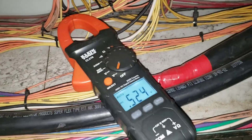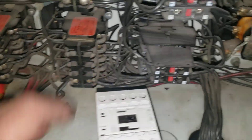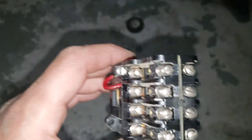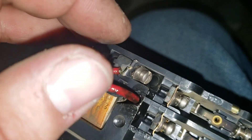It's very difficult to show on the meter, so you'll just have to take my word for it, but we'll get a new one on there right now. Before I take this apart — this is a 4.4 original relay, 4 open, 4 closed. We've got an Eaton, it's a 208 coil, Eaton 4.0 relay with a 0.4 auxiliary. Here's a look at the relay — these are our little shunt wires. If we have a closer look, it looks like we've got it broken. Okay, so that would do it.